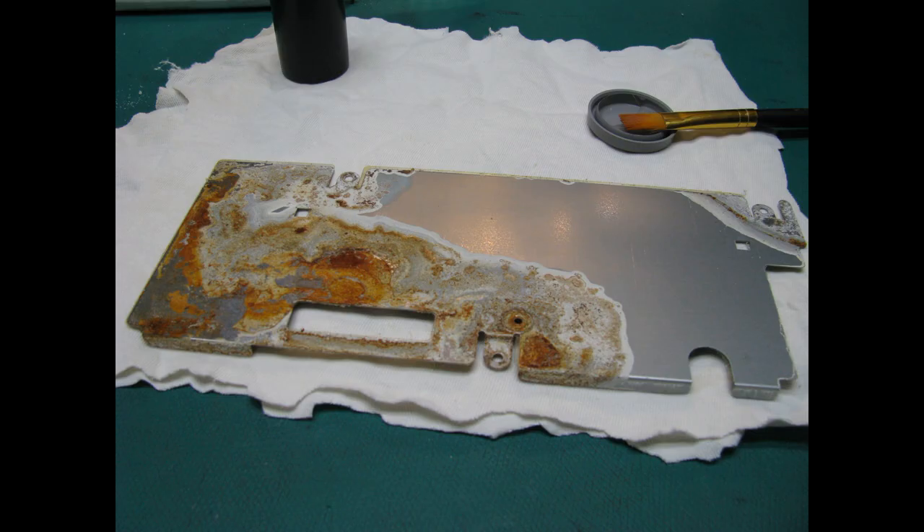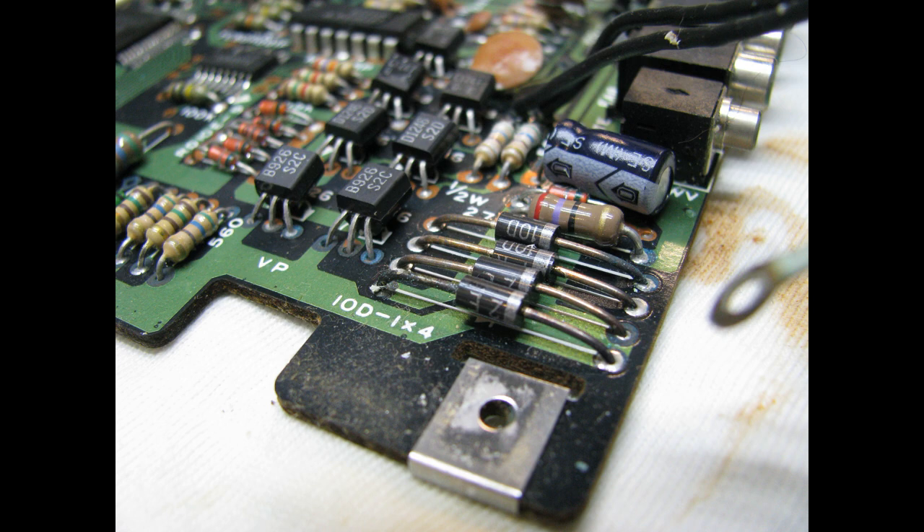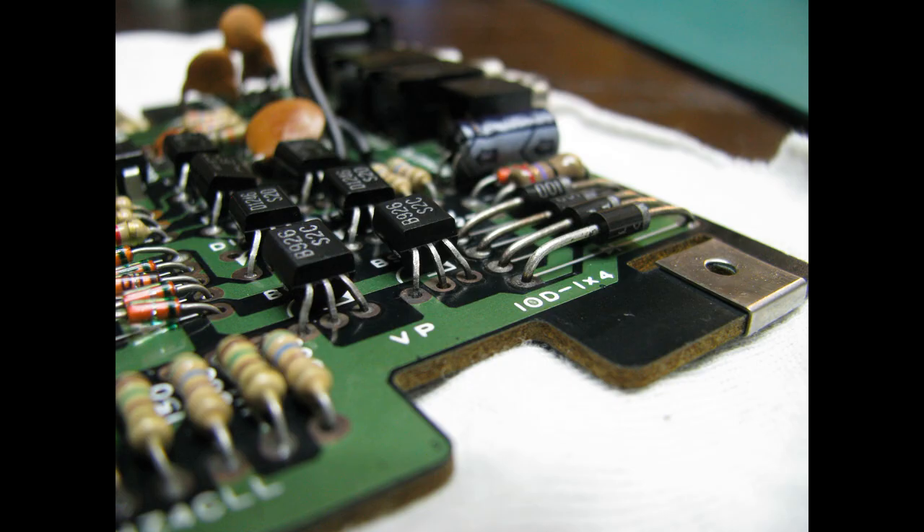The RF shield was badly corroded on the side opposite the PCB, and on the PCB side, which was covered with a sheet of plastic, it was a little more protected. The paint on the underside of the stainless steel docking plate was bubbling up and the leads on a large number of components were turning black. The section of the PCB where the battery leads connected had the most damage. I mixed up a new concoction to remove the corrosion from the PCB — it did a good job, but it'll be the subject of another video as I'm still running tests on the process.